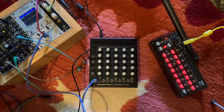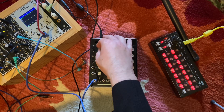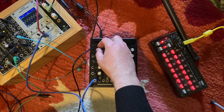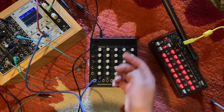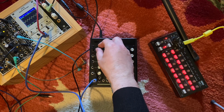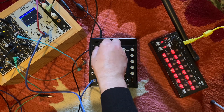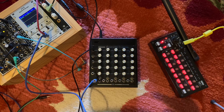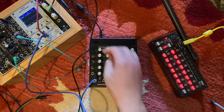So if we plug in — we've got the attenuverter — the scaled output is going to be on the right and the inverted one on the left. If we switch to the attenuverter, this is going to be fully open on the right one. So you can create some interesting sweeps there. If you're mixing this down to mono though, these may cancel each other out. So it's not a true stereo — it's a pseudo-stereo effect that you can get with it.